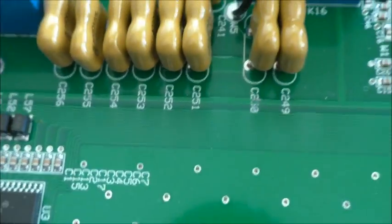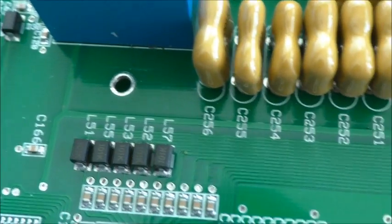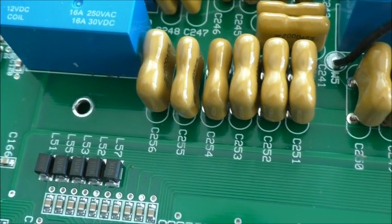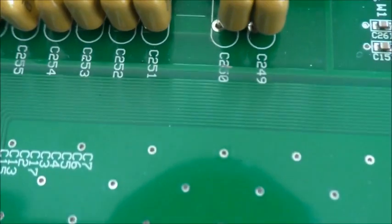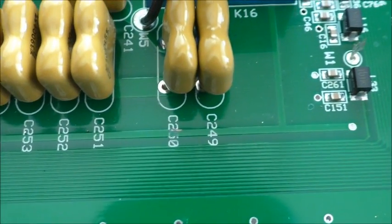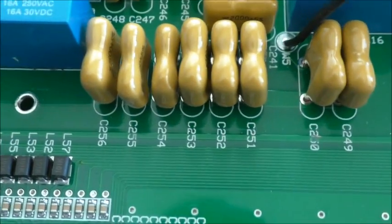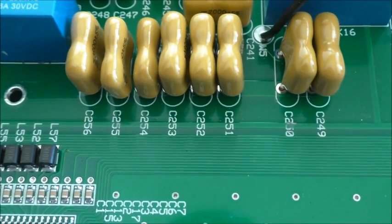So the edge of the case is overlapping onto that bit of print. I'll just have to modify it — I might put a bit of tape on the board across that, just to give it a little bit of extra protection, and see what I can do about refitting the can so that it does not cause that intermittent short.